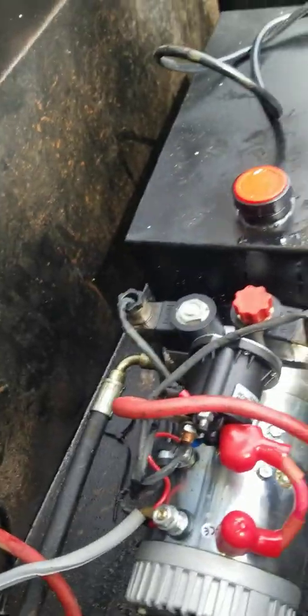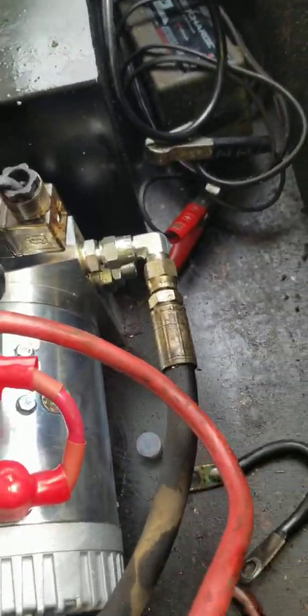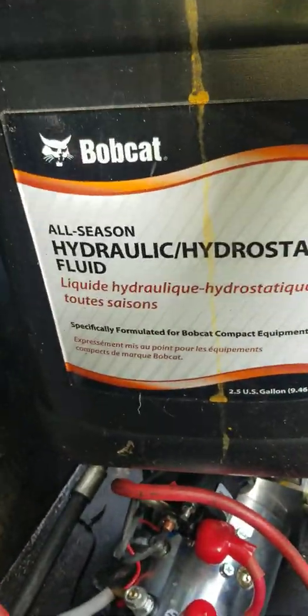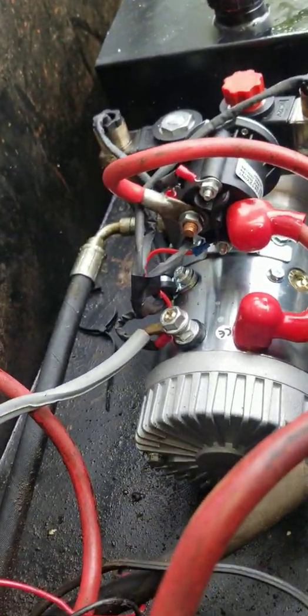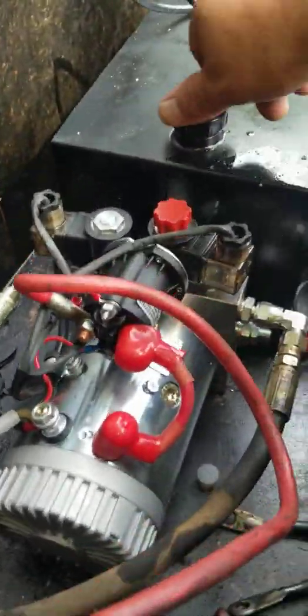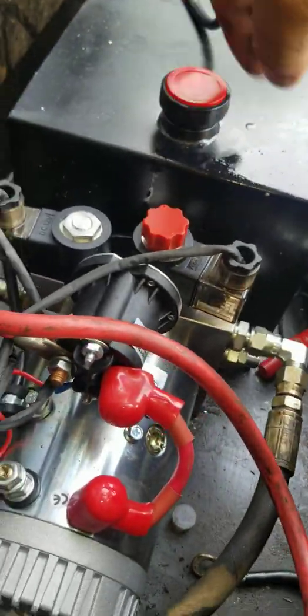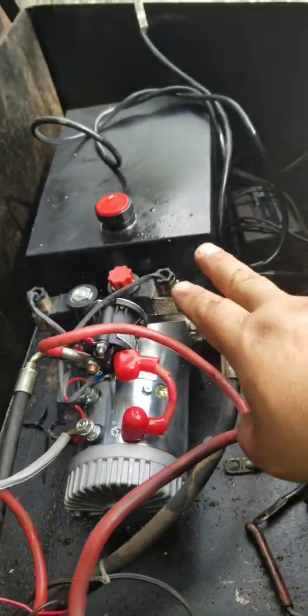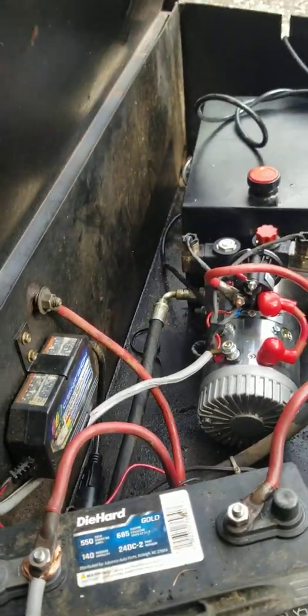The tank comes empty so you've got to fill it up with hydraulic fluid. It's a 12-quart tank. I had some Bobcat hydraulic oil — two and a half gallons — and it's the same thing, it works because it's hydraulic fluid. Make sure you use hydraulic fluid or else it's not going to work. Don't fill it all the way, because when it comes back there's pressure and it builds up too much. That's why I bought the metal tank — the plastic one was inflating and bubbling up when lowering, it was about to explode. The metal one is also cheaper.